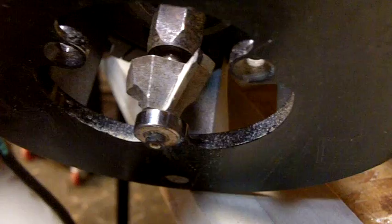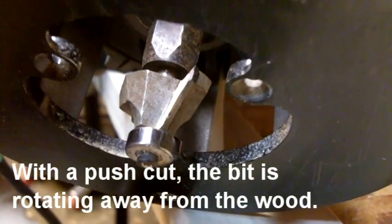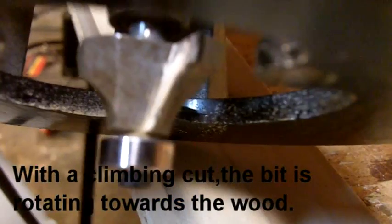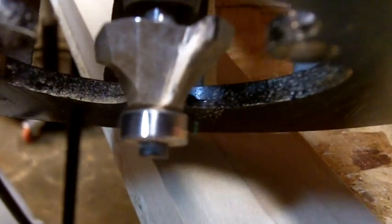What we're going to do is bring you in close and I'm going to show you exactly what a push cut should look like. Now what I have in here is called a round over bit, and the way you can know that you're going in the right direction is the bit will be rotating away from the wood. So I'm going to turn on the router and then turn it off so you can see what direction the blade is moving.